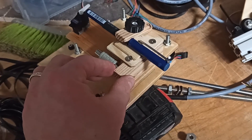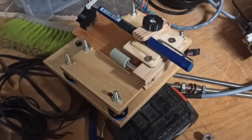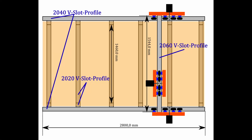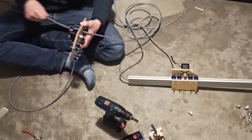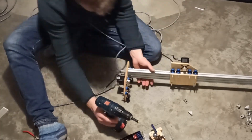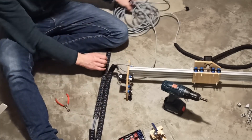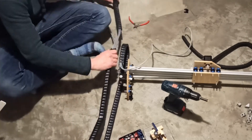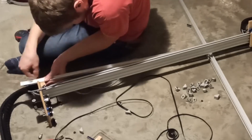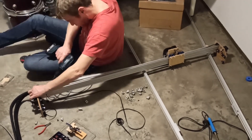The lifting mechanism for the pen I made out of scrap wood and parts of an old 3D printer. Here you see the dimensions of the aluminum profiles. Before I screwed it all together I put a long cable through the X axis profile to reach the second Y axis motor. I also tried to do some cable management with zip ties and a cable chain. In order to prevent the X axis cable chain from touching the ground plate, I mounted an aluminum profile to the side plates.